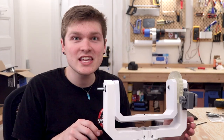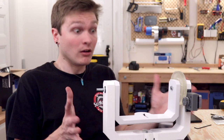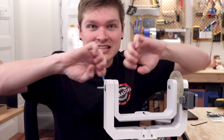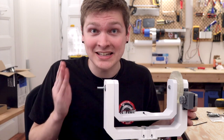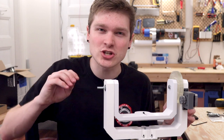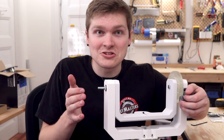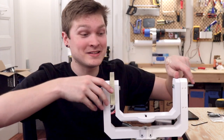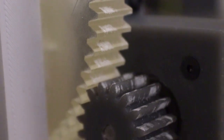This thing is huge! I always feel like that when I print parts that I design in CAD — they feel so much smaller in CAD, and when I print them out, they're so big! So I'm getting most of it together at this point, and there are a couple things I maybe would've done differently. A lot of the gear interfaces — I gave myself no ability to adjust them. I kind of just had to make sure I got it right in CAD, and of course I didn't. So I ended up doing a lot of shimming with washers and nuts. What would've been great is some kind of flexure thing to hold the gears together. What I ended up doing was making sure the gears were a little too tight and then spinning them around for ten minutes so the printed part powder grinds off and gives a smooth interface.